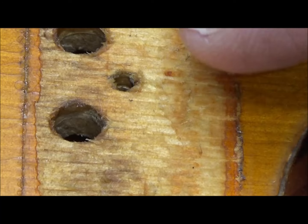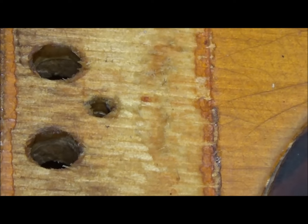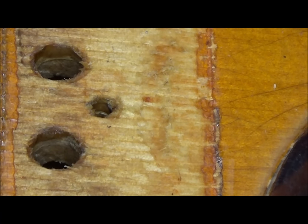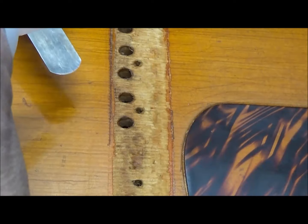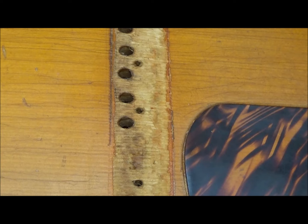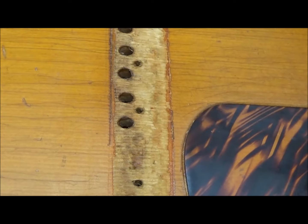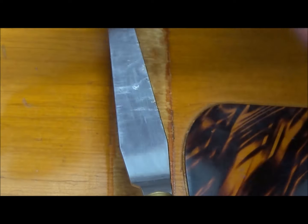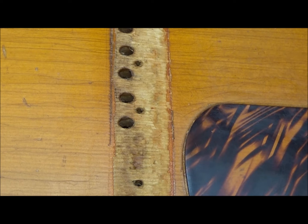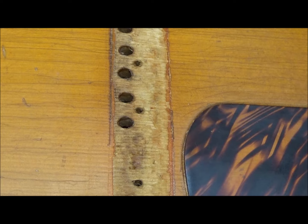After so many years the top started bellying and the bridge started lifting in the back. There wasn't a lot of glue left — those screws had been holding it down so long that most of the glue had just disintegrated. When I was heating up the bridge, I took a feeler gauge, put de-glue goo on it, and got it in under the bridge — there was a lot of space. Then I put a little saliva in a cup — saliva has an enzyme that breaks down hide glue — got it on my spatula, held it under the heat lamp until steaming, and before I could make it halfway around, the whole thing popped off. It only took a couple minutes.